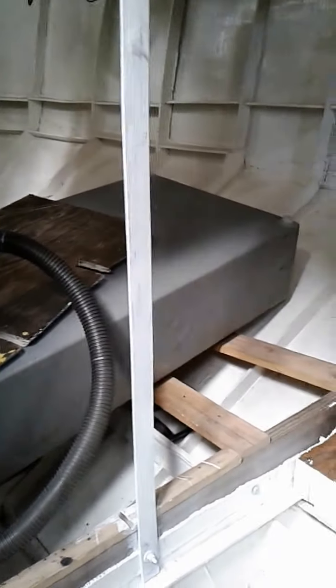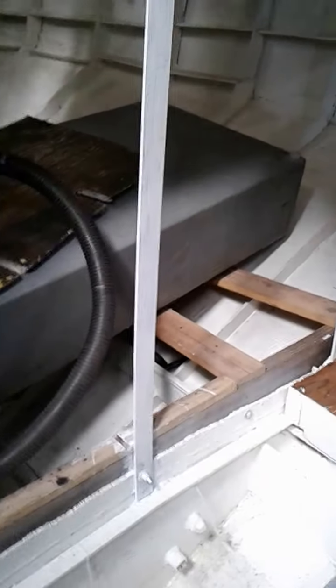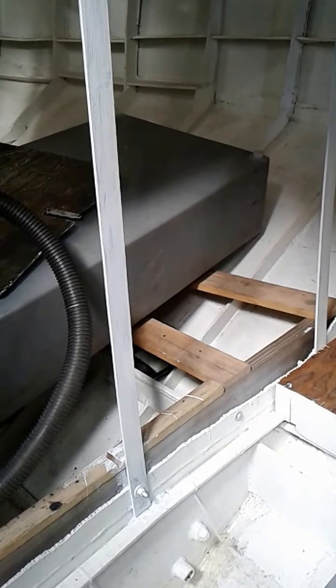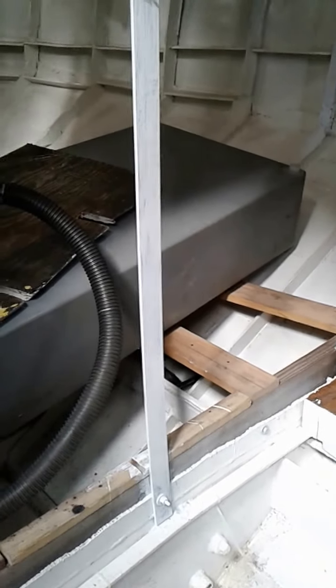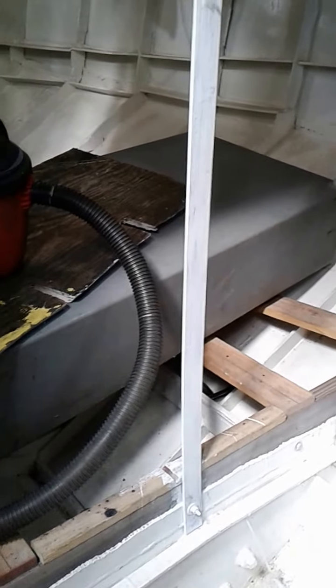We'll move forward here. Finally got some proper deck plates — we're putting straps. These are the side tanks. This tank is going to run athwartships, meaning side to side. It's a polyethylene plastic tank that'll be for water also — makeup water and/or potable water.